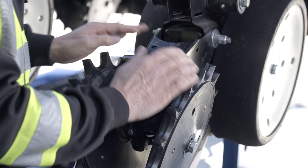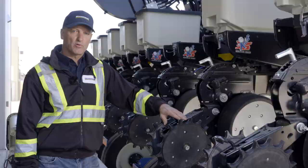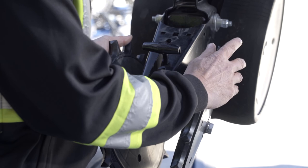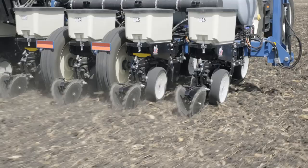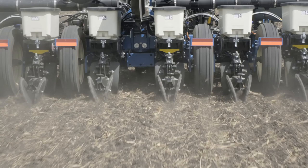There are multiple different types of closing wheels. We had smooth closing wheels on this planter before, but just changed to spike closing wheels. Last fall was wet and we figured going into spring we might have wet, tougher conditions. Your disc and closing wheel can create sidewall compaction; the spiked wheels are more aggressive and can fracture that sidewall. This reduces the risk of sidewall compaction, which you'll verify in the field by making sure you're closing the furrow and checking your alignment.